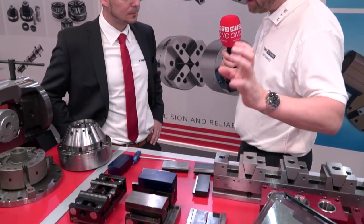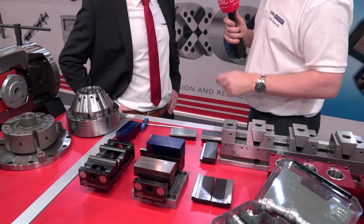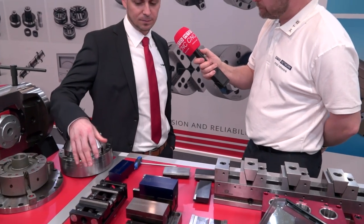What I'd like now is a quick summary of Piranha Clamp. Smallest construction, high performance with 200 Newton meters, two rows, three millimeters — so we lose very little material — open construction for the chips, and the fastest jaw-changing system in the world. Raphael, thank you very much. If you're interested in this product, contact Leader Chuck UK.